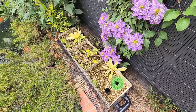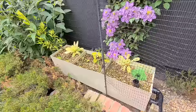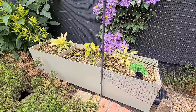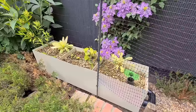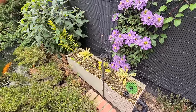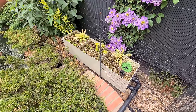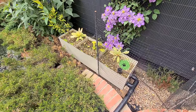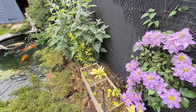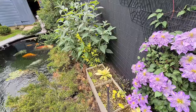I'm going to have to modify it. What I'm going to do is take it out again and cut it down, because it is quite deep - it's a good depth, it's over 30 centimetres. I'm going to cut it down, make it a little bit shorter so it's flowing through all of the gravel. I think we've got all the flow on the bottom and not a lot at the top. The one at the far end has shot up and gone mad, it's actually going into the mud layer.